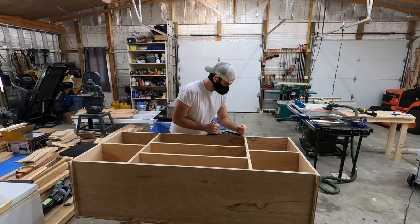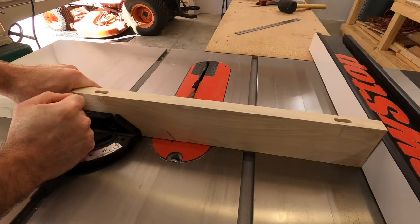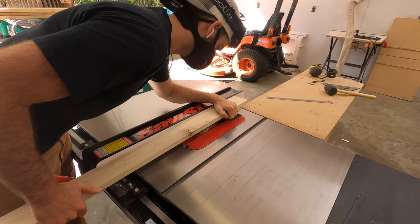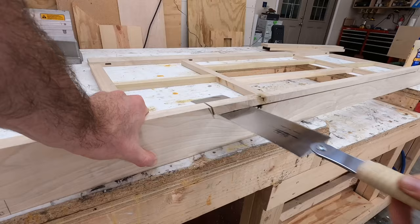Despite gluing and cutting the panels carefully, there were still a couple of sections that weren't completely flush, so I trimmed them down using the hand plane in preparation for the face frame to sit flush on the cabinet. On the very bottom piece of the face frame, I wanted a little more detail and an elevated look, so I used the table saw to cut a couple of angled cuts and then raised the blade to make a recessed cut. Just a heads up — doing that is a little bit sketchy, and if you don't have the board pinned down you are asking for kickback, so please use caution.